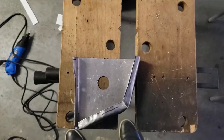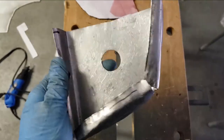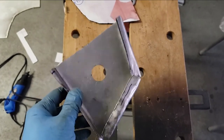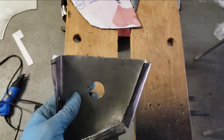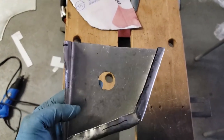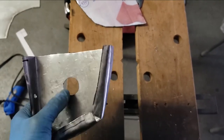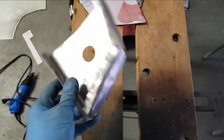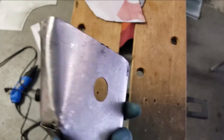So hours later, I finally manufactured this inner wheel arch piece. It's a whole bunch of hammering and cutting. After I finished managing to shape it the way it is, I drilled out a hole here for the spot weld and a hole here for the grommet. It looks pretty good and fits pretty good. I'll show you guys how it fits with the rocker.